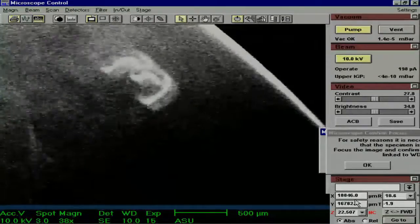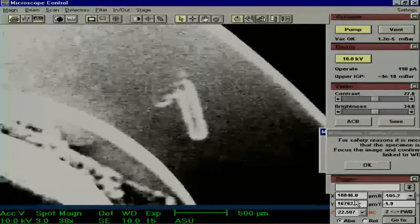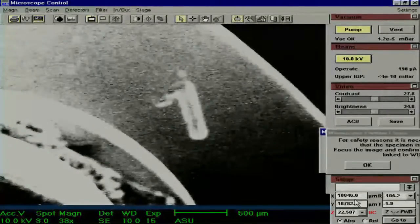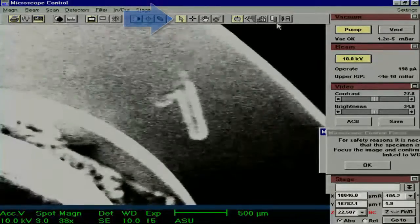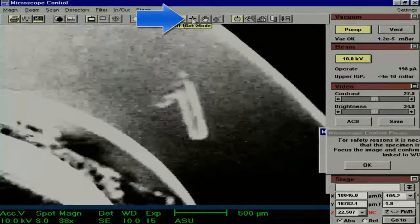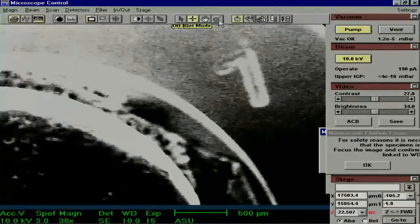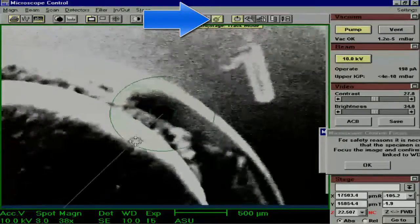Now we are at the edge of the stage, so we can use the rotation knob on the microscope to rotate and find the sample. You will be able to see numbers on the stage — rotate until you find the number of the slot where you placed your sample. Now that we have found our sample, we want to find a feature that we are interested in, which will normally be the tallest feature. There are different ways to navigate using the software: the pointer mode just points, the get mode will center on anything you double click on, and the most popular way is track mode, where you click and drag the mouse and the screen will follow.